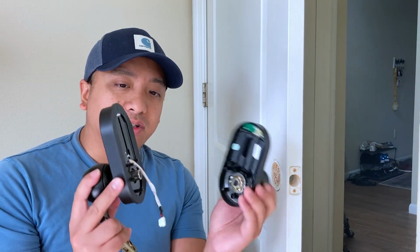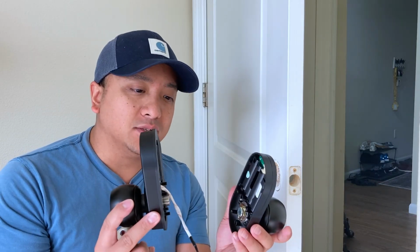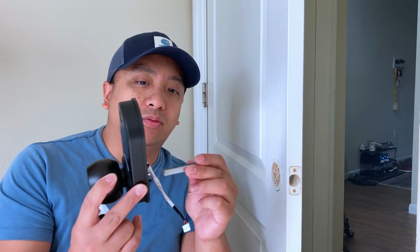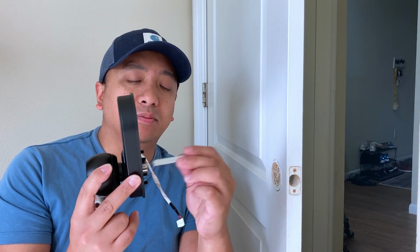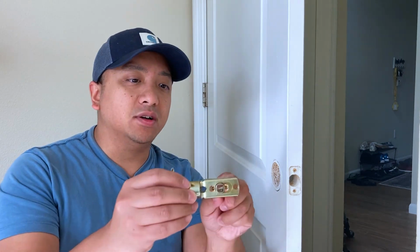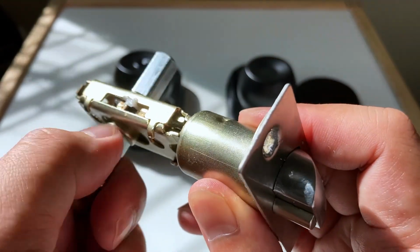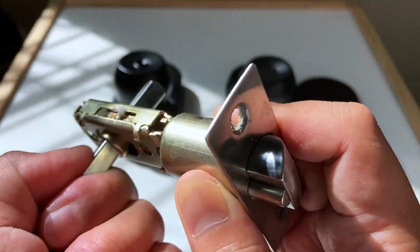So the next step after that, of course, would be to install the latch mechanism. Now, if you're new to this whole thing, installing a new knob, it may be daunting at first, but it's really quite a simple mechanism. Basically, you've got your 2 doorknobs, and then running in between them will be this metal rod. So that's going to be twisting when you twist the doorknob, and then that rod goes through here, and essentially by twisting and turning it, it will translate to this going in and out. So we're going to install the latch first.